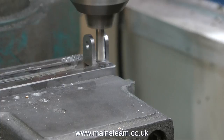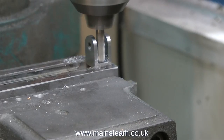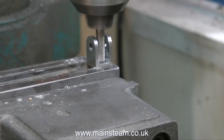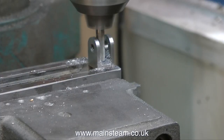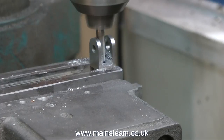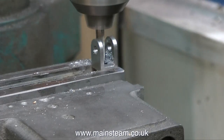I then put it in the milling machine, and very carefully - and I mean carefully, because you don't have a lot of steel to hold in the machine vise - very carefully remove the excess metal. It's not difficult, you just need a bit of patience. And once again I'm going to run this in real time. You need a very delicate touch with a piece of metal as small as this. It's also most important to keep the chips out of the way so you can see what you're doing. If you let your mind wander for a moment you're likely to foul up and destroy the part.